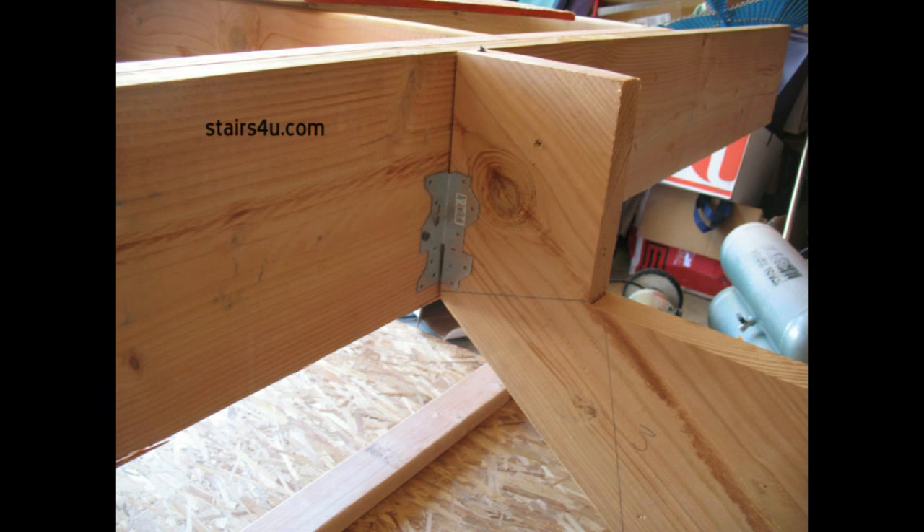Put a little common sense into this if you're going to be building stairs. If you're going to put a hanger on one side, make sure there's a hanger on the other side, or some type of additional reinforcement so nothing separates. The main reason I made this video was to show how much horizontal reinforcement you can get by using plywood. You would not get that same effect by using individual deck boards — two by sixes or manufactured decking materials — because each break will provide you with a weak spot in the construction.